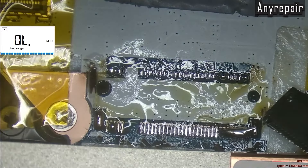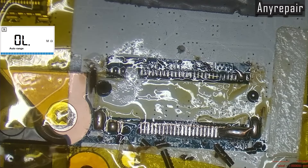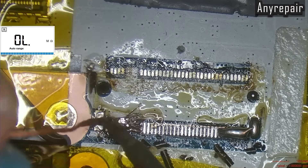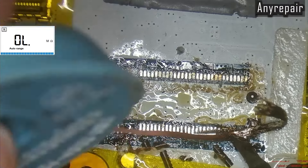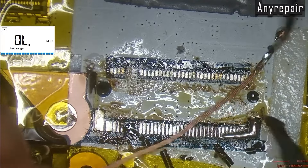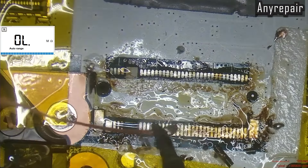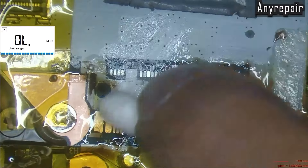It is moving and it is off. Now we must clean. We will use a soldering wick and our soldering iron to remove the low melt solder that we added previously. We clean every single millimeter of these pads, removing the low melt solder. Using flux is always good advice.